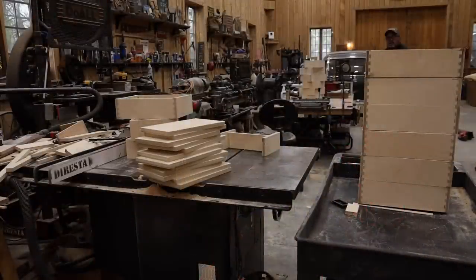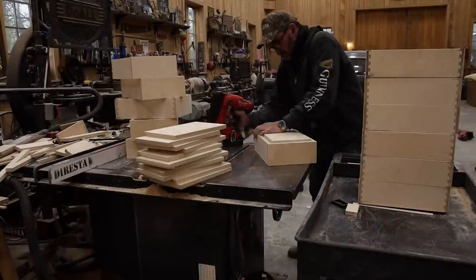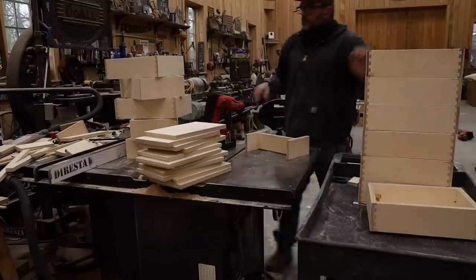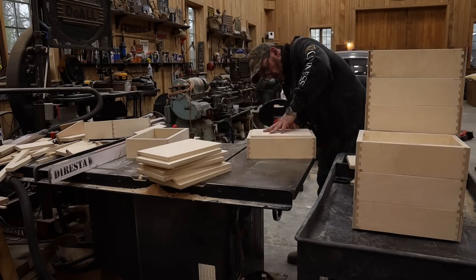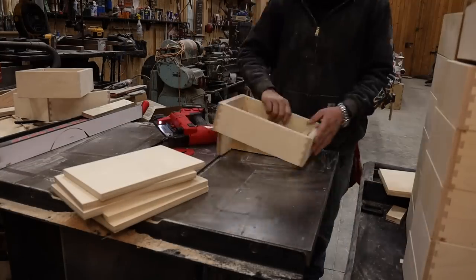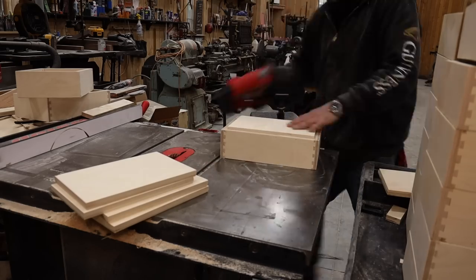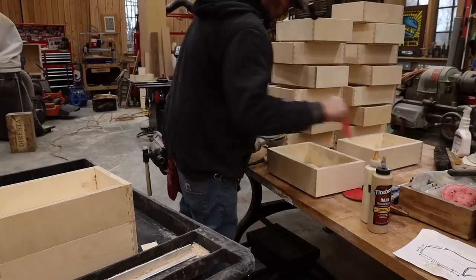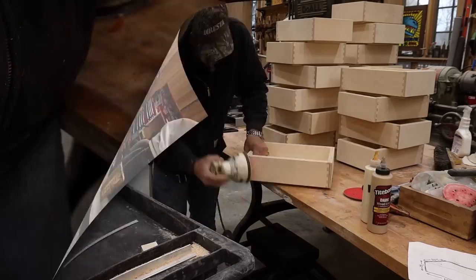You can see how those stack. I didn't want to go crazy with glue and get it all over everything, knowing I wanted to paint it later with polyurethane. Having that little T-jig inside the box helps me see exactly where I need to be, and working on the flat steel surface of the table saw top means everything lines up nice. It's a bit tricky putting those 18-gauge brad nails in there — I had to pull out a couple that went astray. I typically just break them off; they break right at the surface and usually stay below the surface.